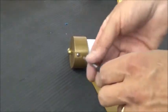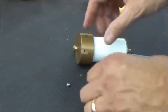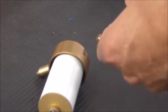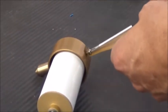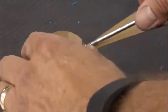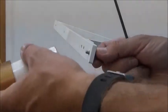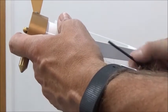Now you need to put together your wind direction sensor — just remove the side screw, place it in the tail section, and replace the screw and snug it up. That shows the correct orientation. Then take the screw at the base and replace it once you line it up on the bracket.